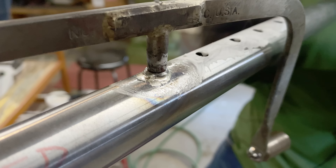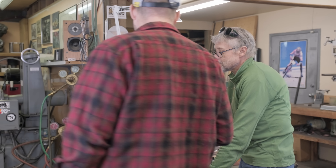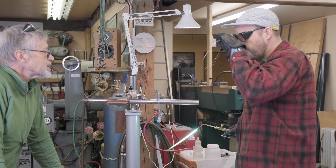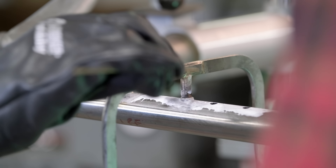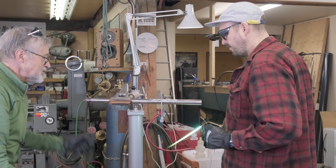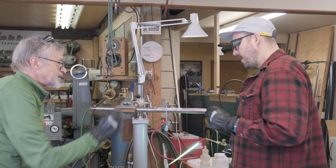It's Thomas's turn now. He's going to do a silver solder around here and then I'll see if I can help him. I don't need to put much heat on the heat sink because it already got some. You can put a little bit of heat on the heat sink, then get a blob here, work it around. I would put a very small blob over here — hold the cone almost touching, have it close.